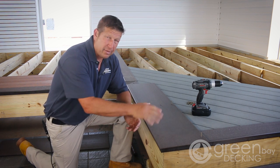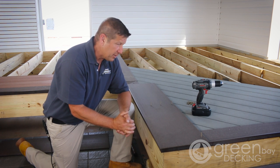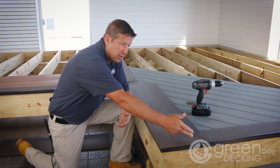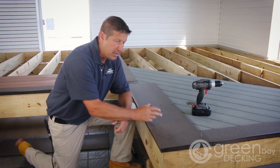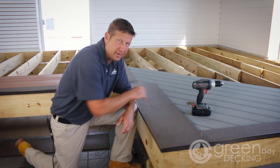We're going to talk about installation. I'm going to throw a couple pieces on and there are a couple different ways we can install this. The basic installation requirements are that we get three screws every 12 inches, unless we're ripping this to six inches or less, and then we only need two screws every 12 inches.